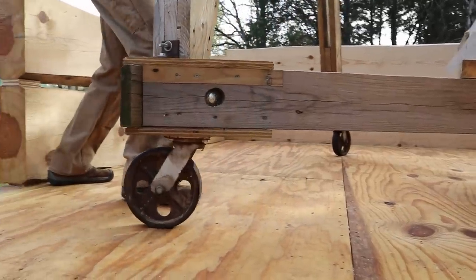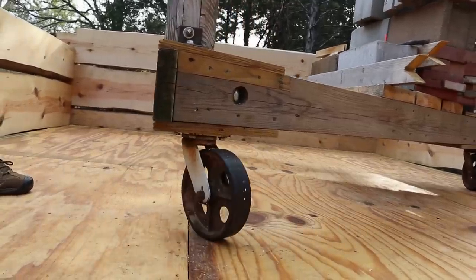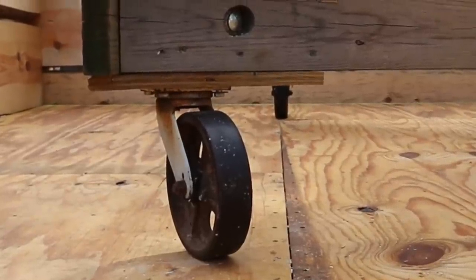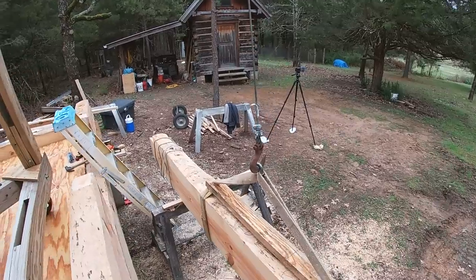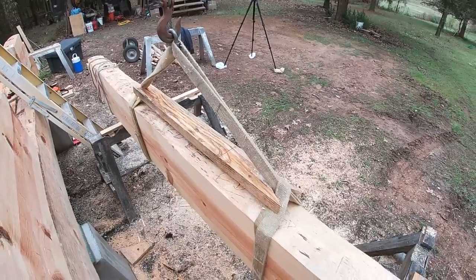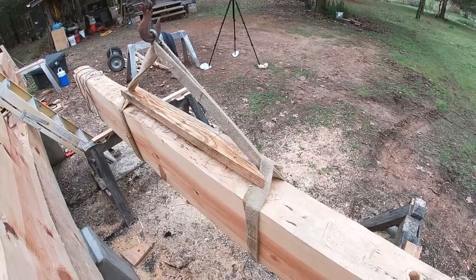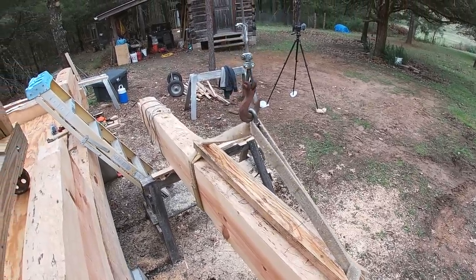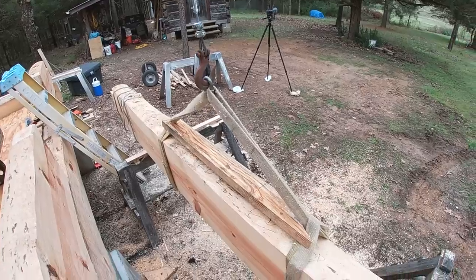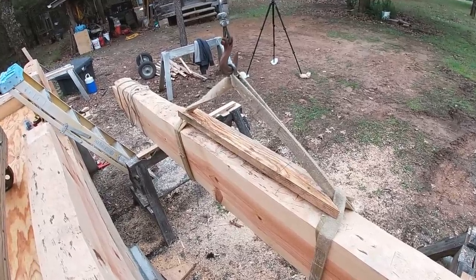There are swivel wheels on the base — I can move it around and they will turn even with the load on it. Each one will hold up 750 pounds. I have a hook hooked into a carabiner into the lifting straps. I recommend using straps on your logs. I do not like to see log chains wrapped around a log — it just makes little marks in it. If you go to the trouble to make a really pretty log and do all the work to it, you really don't want to be boogering it up with a log chain. I use lifting straps a whole lot. You can see I have a stretcher piece in there that keeps the straps in the right place on the log.